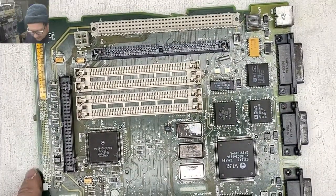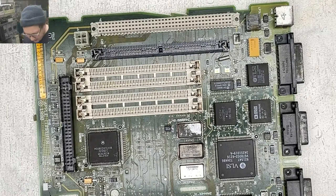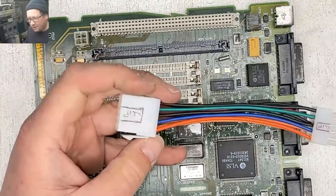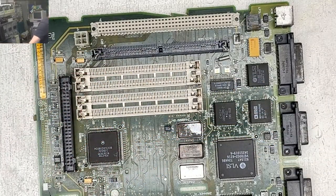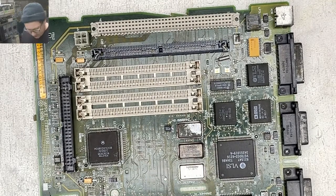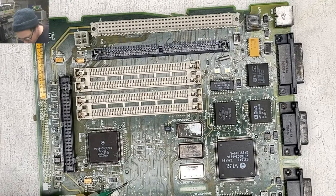Oh, you want to use a Seasonic to do a mod? Oh, man, I wouldn't do that. I would just get an ATX extension. This is one I use, like a little extension to do an adapter on. And you don't have to destroy a power supply in case you decide not to keep it that way.